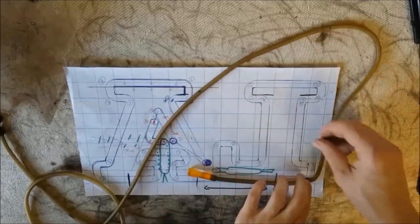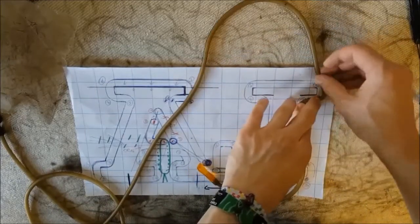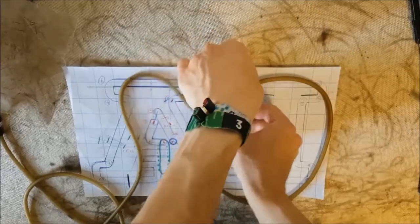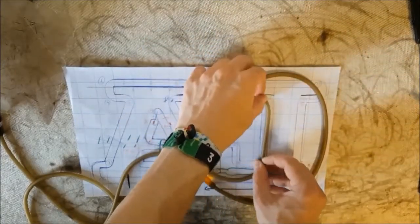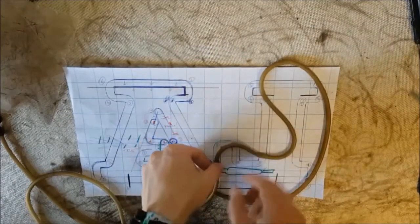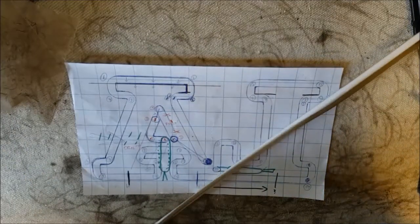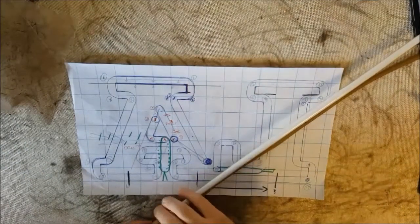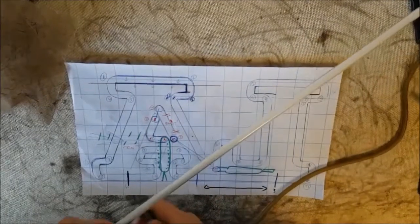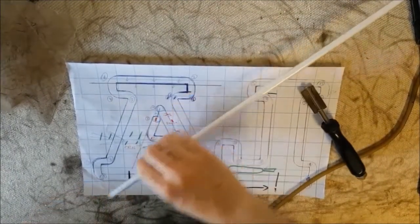Alright, I'm measuring the length of glass that I need for the letter L with the blow hose. The longer the stick of glass is, the more difficult it is to handle in the fires, so I'm not using a full stick, but just the length that I need. Now I'm bringing that length to the glass, cutting it with the hard metal knife and breaking it off.